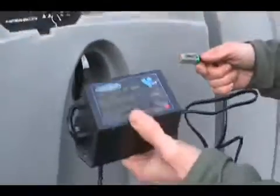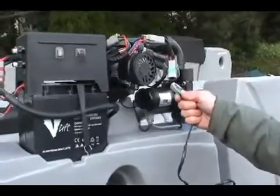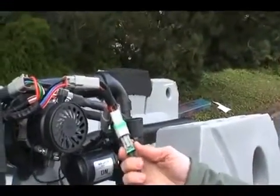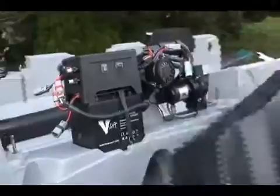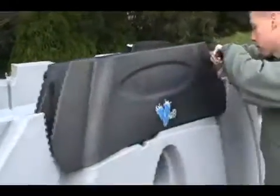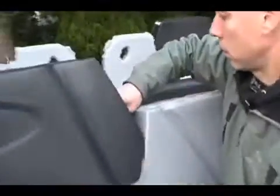The charger is designed to go on the dock with a cable that runs to the lift. It can be plugged into any of the green plugs — there will be one at the end of each harness on each tank, plus two additional ones on each battery. Any plug will charge the entire system. The covers are simply placed over the studs and the knobs are tightened down.